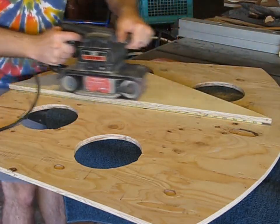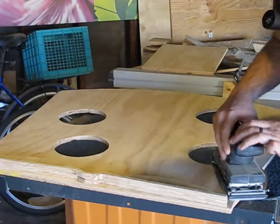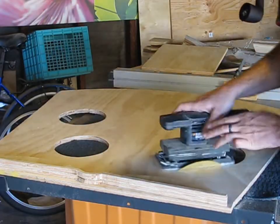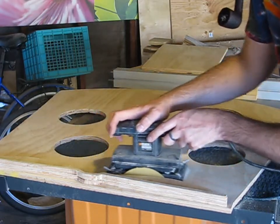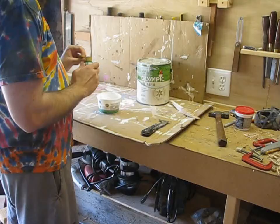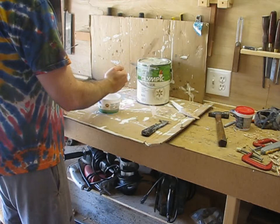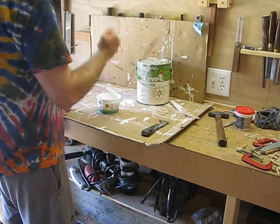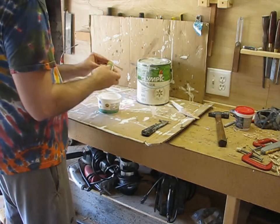The screws that came with it were a little too long for the board, but my belt sander took care of that. This plywood was pre-sanded so it only needed a little bit of touch-up before it was ready to paint. I'm painting this with a gloss enamel over a PVA primer — they're both water-based, and like most water-based house paint you can easily tint them with a few drops of acrylic craft paint.